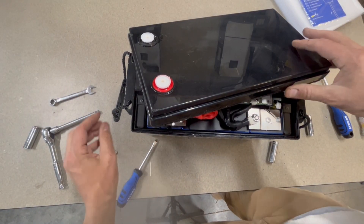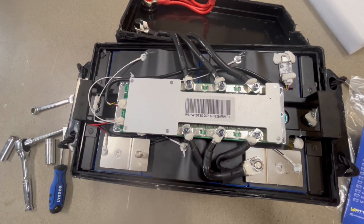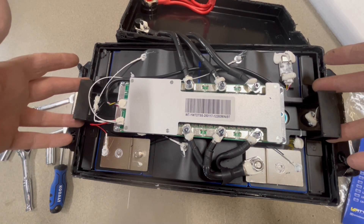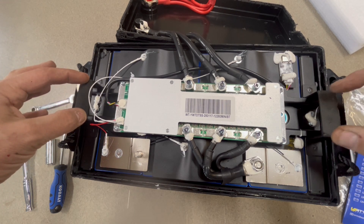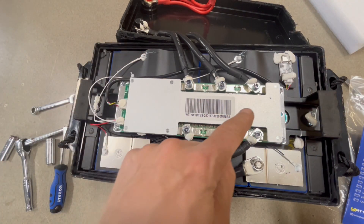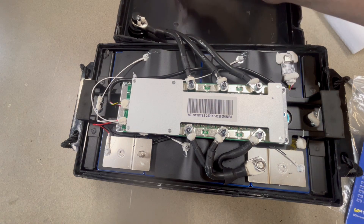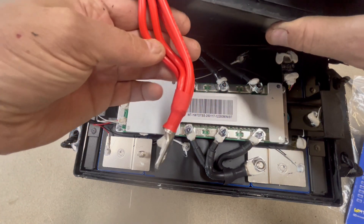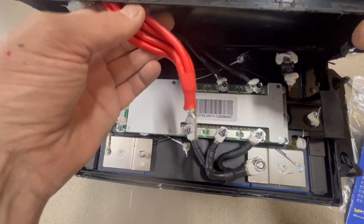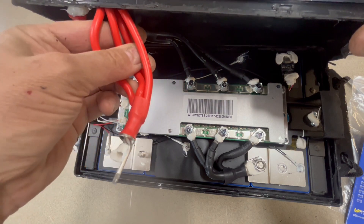I just took the nut off the positive to get the lid off. So with the lid off, looking at the top here, this is one reason I like WattCycle — they did this in their mini battery also. They have metal on the sides not only to bind the cells, but they leave these up here on the top with some foam padding on them, and those protect the lid from crushing in and provide spacers for the BMS. On the negative side we have three 6-gauge, 200-degree Celsius wires. The positive side has four 8-gauge, 200-degree Celsius wires. It seems like they could have used a higher-gauge wire and skipped having multiple stranded wires, since down to 2-gauge these are extremely flexible.